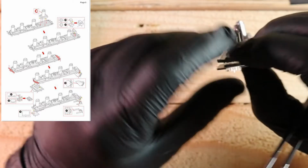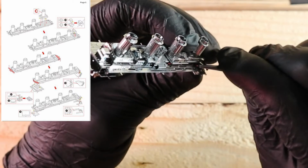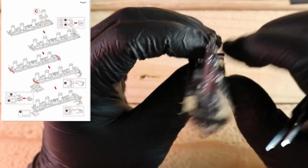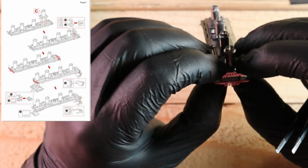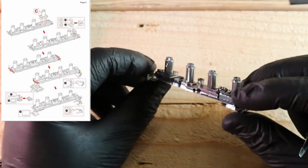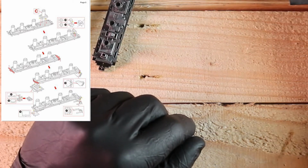And there we go. Go out to the other side here. And we're going to push on this while we're doing this as well. The reason why we're pushing on it is we want to get as much of this in the bend as possible so our tabs all line up and there's no gaps. We don't like gaps. We're on gaps, people. We're on gaps. That looks great. Let's put that down now and go over here and grab our other part.